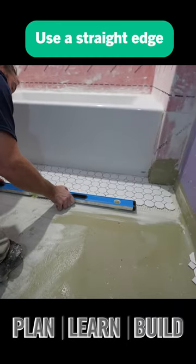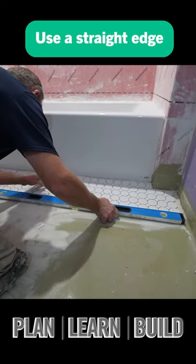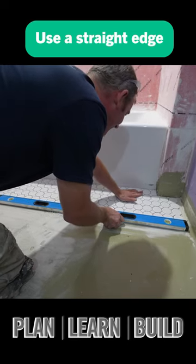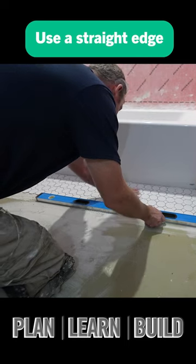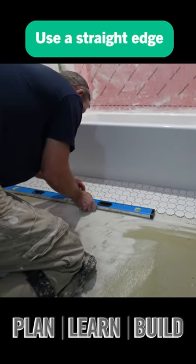Make sure that you stay flat. I'm just going to use a straight edge to make sure that my tiles are all in a line, because that will make a difference — it will kind of grow on you in some fashions and be problematic. So if you get this first row straight, then you can basically just eye it up for the rest of the time.